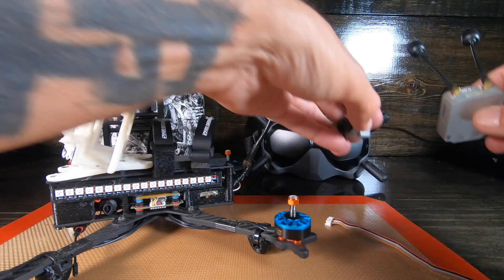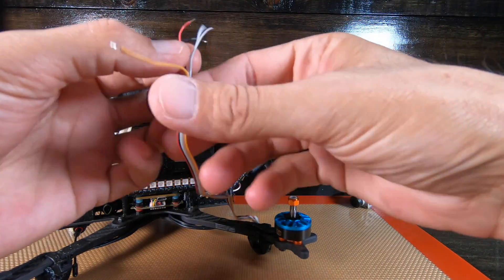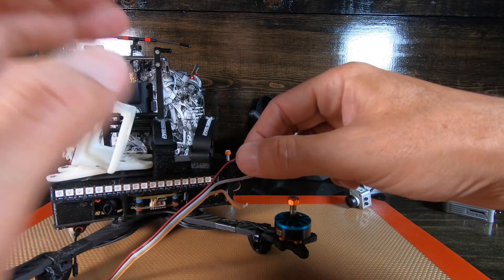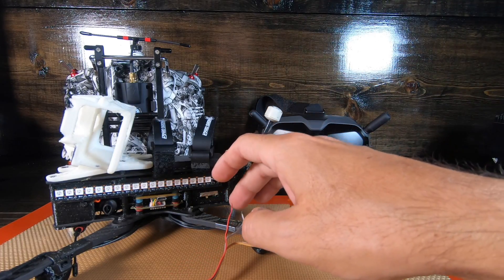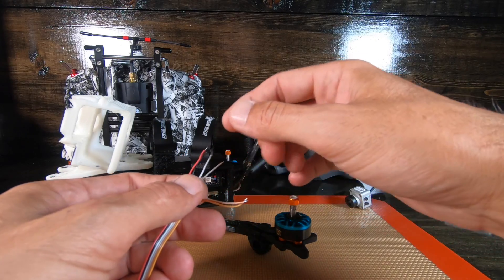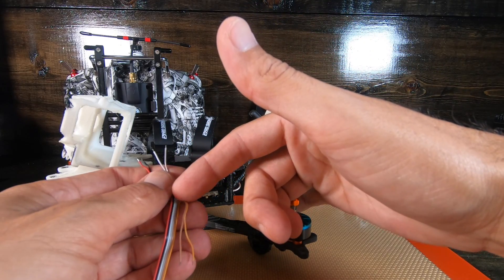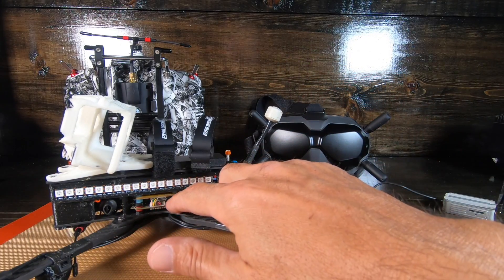From what I've seen with the wire harness, if you're just going to hook this camera up and not use OSD or anything, all you do is power it with 2S to 4S and that's it. But if you want your OSD working and be able to adjust your PIDs - and maybe don't have LUA scripts - you have to use the white and gray wire. If you're going to use DJI's radio system you'd use these two, but we're not doing that. So we only need to worry about these four wires, and we just need an open UART on our board. I'm using a PyroFlip F4 board.